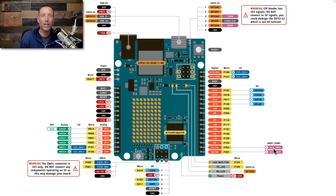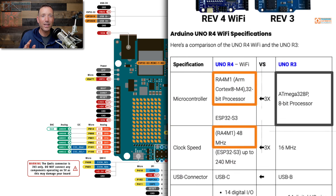I'm excited that the new R4 processor uses a Cortex M series core, which is pretty standardized and used by a ton of companies. The RA4M1 clocks at only 48 megahertz compared to the possible 240 megahertz of the ESP32 S3, but the reason for this is a power trade-off. Since the RA4M1 runs at 5 volts, one way to keep power consumption lower is to reduce that clock speed, which is why they went with 48 megahertz. For the kind of control applications I normally work with on an Arduino Uno — reading sensors and turning on actuators — I really never ran into clock speed issues.